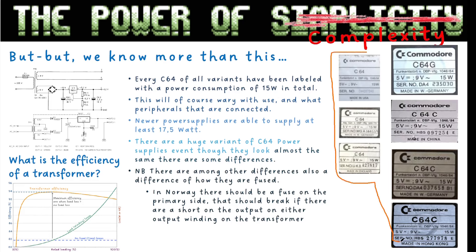What is stated on every C64 I've found is that together on the 5 volt rail and the 9 volt rail they pull 15 watts, with a maximum available of about 18 watts. Of course they don't always draw that much, because the C64G, original C64, and C64C have different power draw — fewer RAM chips and fewer oscillator chips mean less power. The newer C64Cs with 85-series chips draw only about a tenth of the power of older circuits.